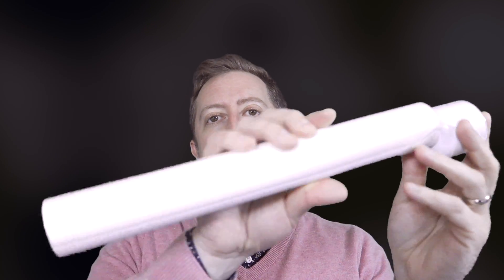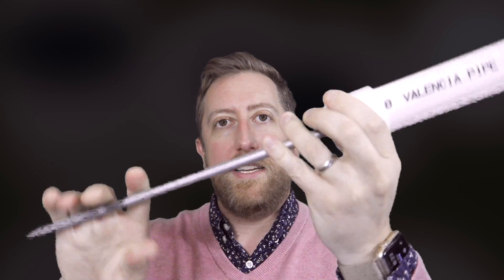You don't really need to guy the antenna at that point unless it's really windy. You will be putting a lot of the support on the legs of your dipole if you're using a dipole, which I recommend with this particular setup. This isn't the solution for all things, but it gets you most of the way there. It's really good for a park deployment — something where you have soft soil that's easy to push the spike into. You generally just want to push it in. Anyway, that's it — that's the super simple antenna mast spike PVC kit.